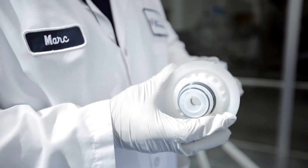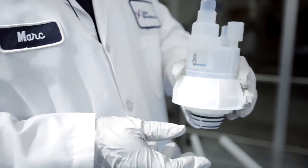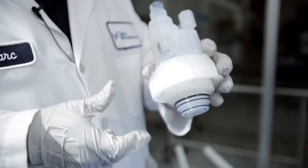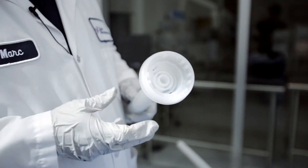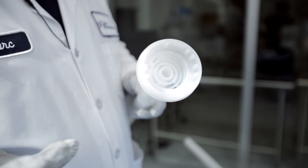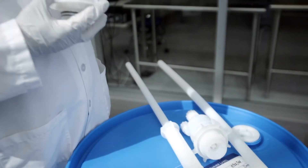I'll have an example for you when we do a demonstration. Conversely, the QC3, which is a newer design from Integris, is perfectly designed for feed and return applications. It has a three-quarter inch feed port, a three-quarter inch return port, and a very open return path for the slurry to come back into the drum. This open mesh allows the slurry to return to the drum without any added shear or pressure drops, really avoiding any of the issues. So if you're going to use an Integris dispense head for a feed and return application, definitely use the QC3.